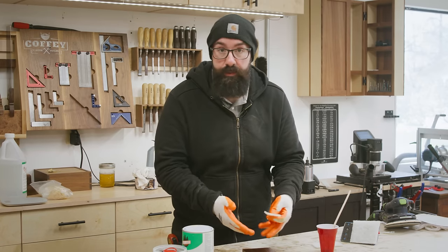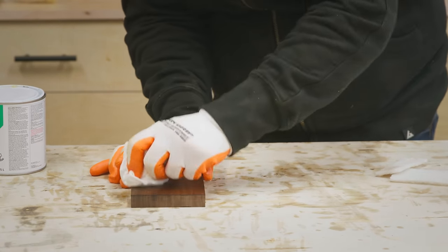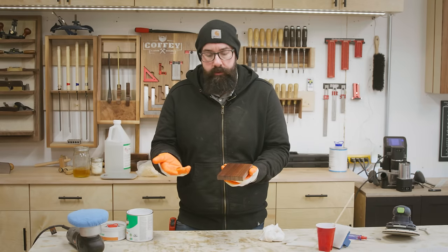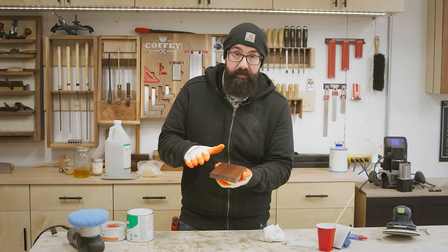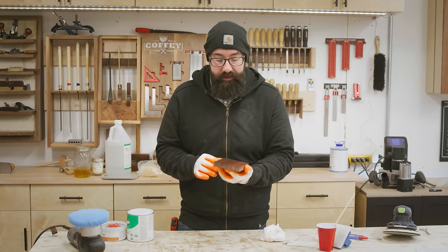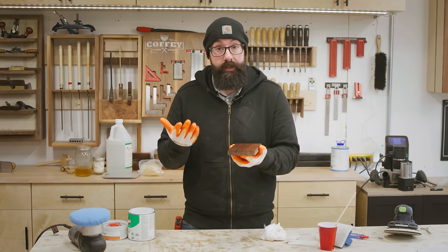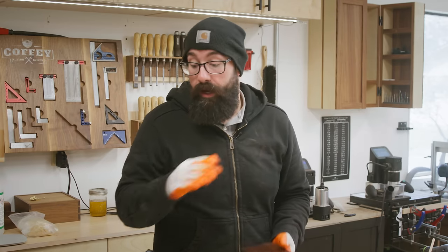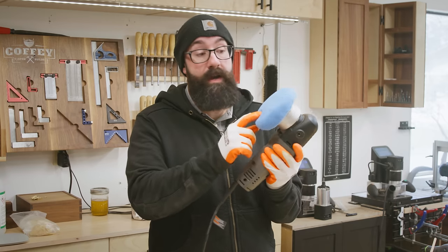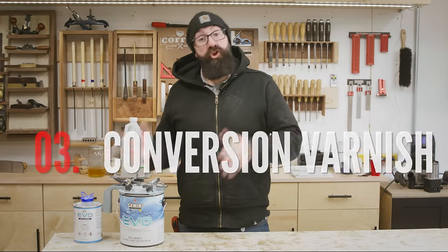Now that it's coated, we're going to wait 12 to 15 minutes and then come back with a white rag and wipe off all the excess — it's as simple as that. The manufacturer says you only need one coat, but I don't really subscribe to that. One coat gives a very flat or matte sheen, which is desirable sometimes, but I think it's often a little too flat. So I like to add another coat, which not only raises the sheen a little but also gives it more durability. After the second coat I buff off the excess 15 minutes later. Then I take my polisher with a microfiber bonnet and go over the whole surface slowly — the heat activates the wax and causes the curing process to start even faster.